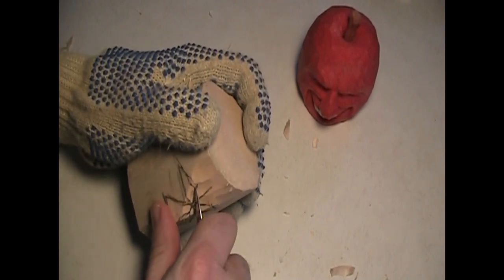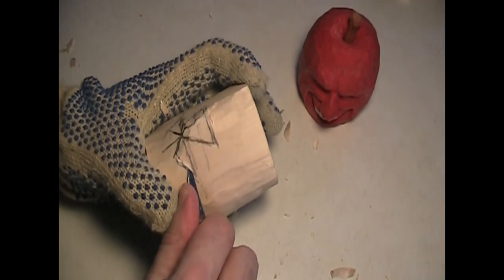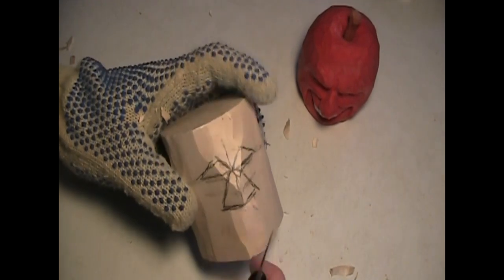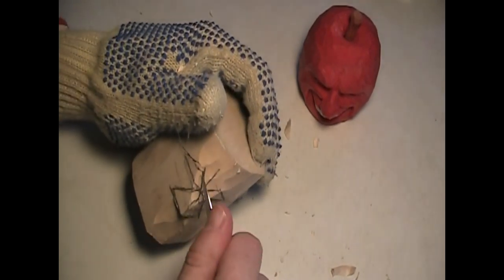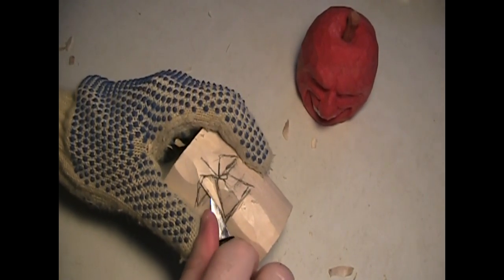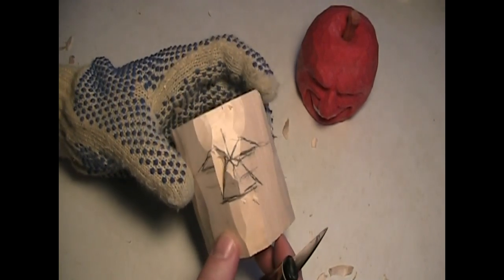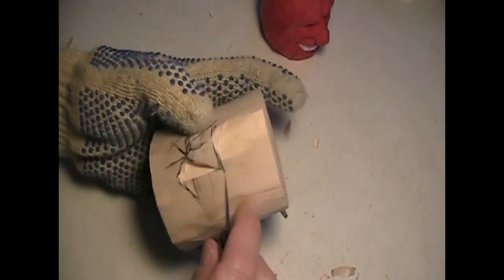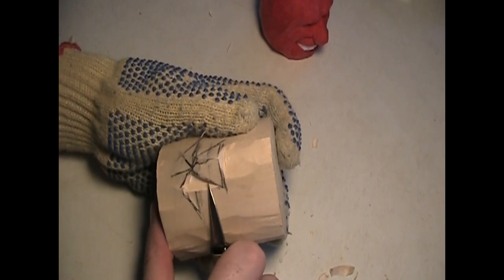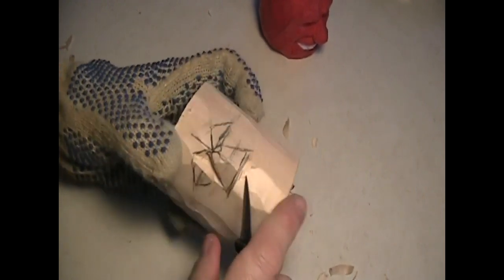Here it's going to start shallow and then dig down deeper. This end is going to be sort of a medium cut — this is just to get started. Now we're going to make chips: go from the high point here to the low point there, carving in because these two cuts went this way. We're just getting started — don't worry about not taking a big chip off right away; it could take a few swipes before you get even this much out. We're going to go much much deeper. This next cut is going to be parallel with the eye line, going halfway up the nose and then down deeper into the eye line — and the chip should come out.